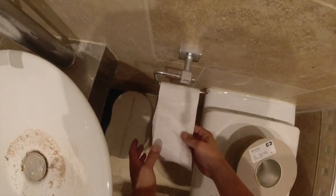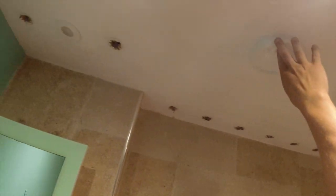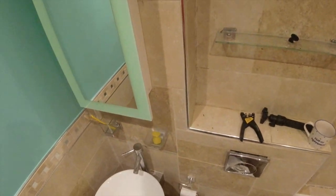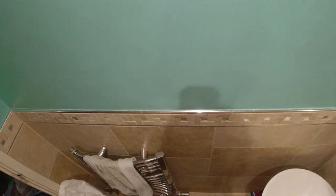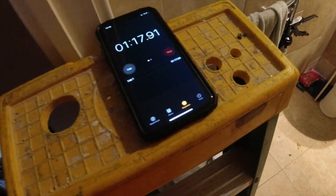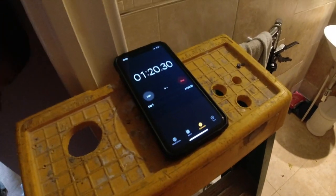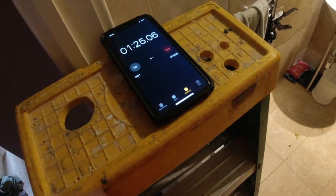And what we do, let's get this, James. This is the official. Look at that. Brilliant. Beautiful. So, we got a bit of a clean up to do, haven't we? Yeah. And then we'll set the time on that fan, yeah? Switch the lights off that control the fan switch line, put the phone on and listen for the fan when it goes off, and then if we need to increase it we'll turn the switch up a bit, but I think it should go for about 2 minutes, and then we'll increase it a little bit, I think.